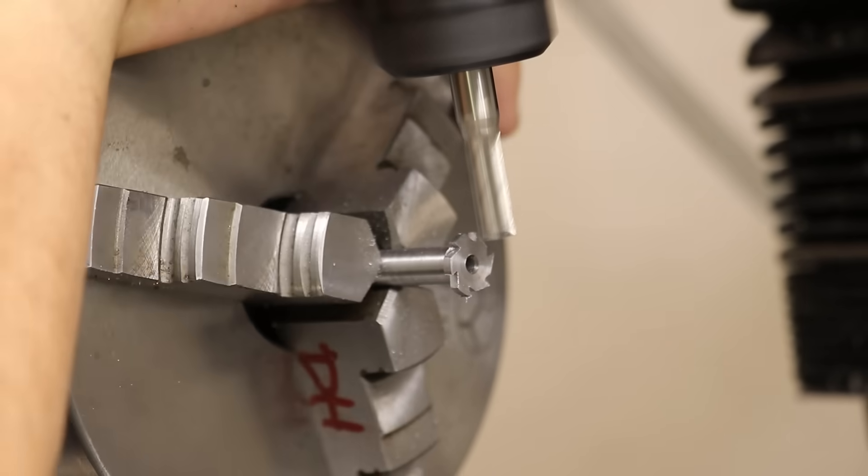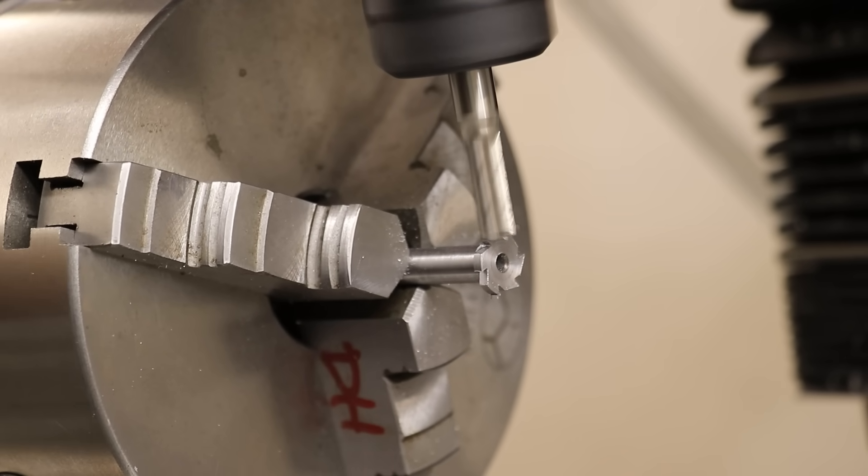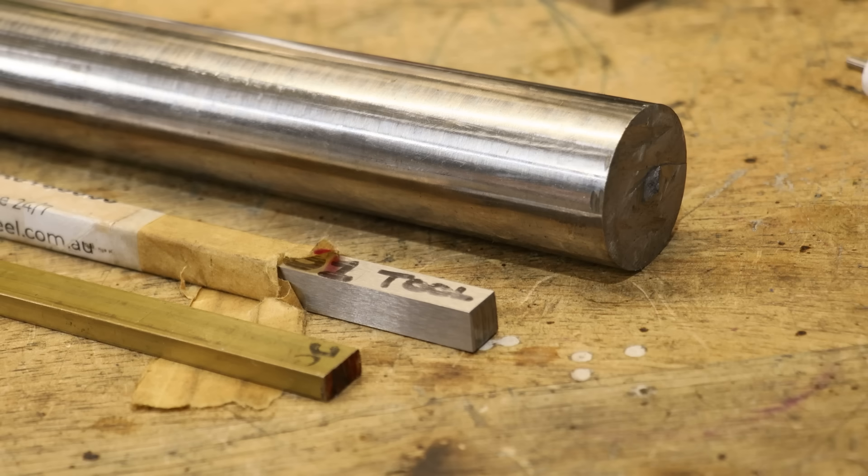So I knew there had to be an easier way. Instead, what I'm going to do is go for a simple single point cutter, which should give me an accurate profile for cutting with the proper relief cut in. For the materials, I have some 4140 for the tool holder — it didn't have to be 4140, it could have been 1020 or something else, but this is in the right size. I also have some O1 tool steel for the cutter — W1 or anything similar should work fine. And finally some brass, which I originally was going to use as shim, but this will be replaced later in the video.